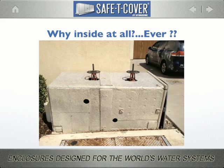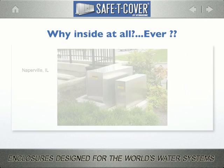In the foreground there, you see a vault. Previously, they had put a double-check backflow preventer down in that vault, no doubt next to the meter. Later, the city changed their mind on what was required and asked them to move the device above ground and install an RPZ. Sadly, the enclosure they chose was not of sufficient height to allow full coverage of those OS&Y valve shutoffs, so they just made holes for them. This is actually a fiberglass shower stall that they've decided to call an enclosure.